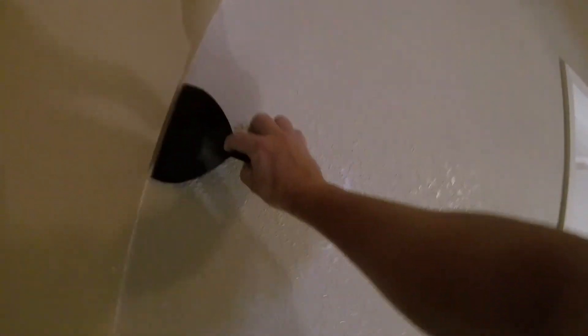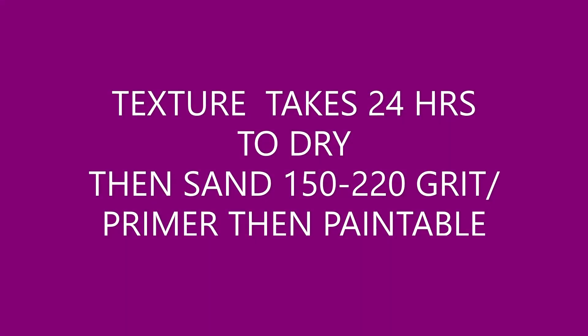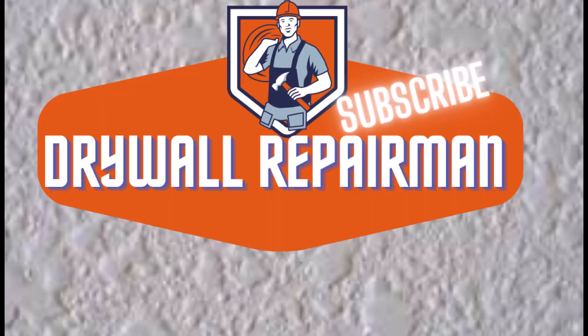Get your work area all cleaned up, take it out to the washout area, and wash up all your tools. Follow through the job, double-check, clean the floors, get everything cleaned up. Then you're just going to have to let your texture dry for at least 24 hours — that's the rule of thumb for joint compound and any type of mud. After 24 hours, I recommend sanding with a sanding block, either fine or medium, with sandpaper between 150 and 220 grit. Sand it, then primer — you always have to sand it.